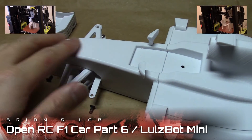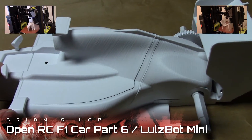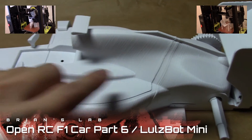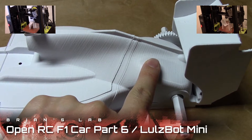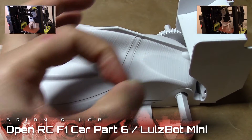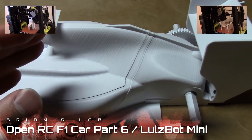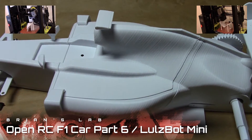— at least took three, five, six, seven hours a piece, so that required a lot of printing. On top of that, each of these pieces, especially the motor cover, had a lot of pockets to insert tiny nuts in, and those holes all ended up being too small, so I had to use a Dremel tool to open those up.